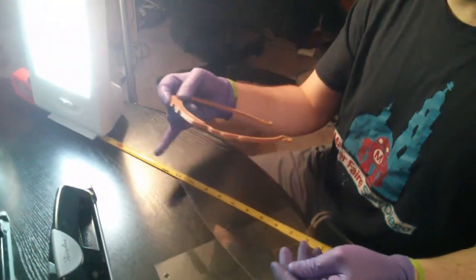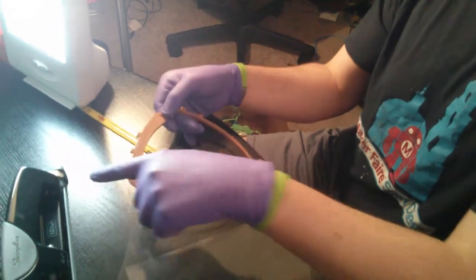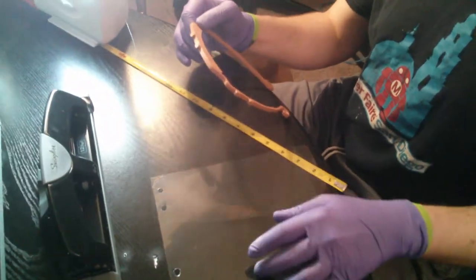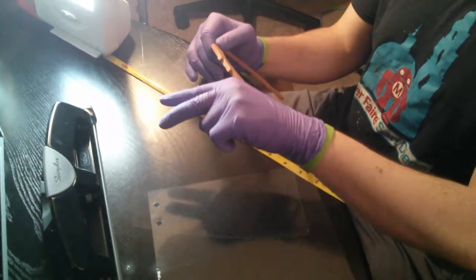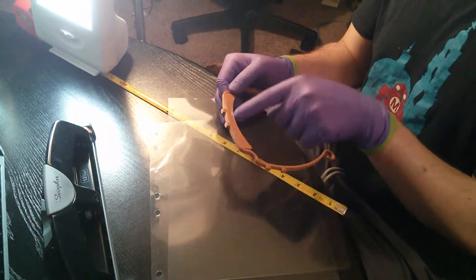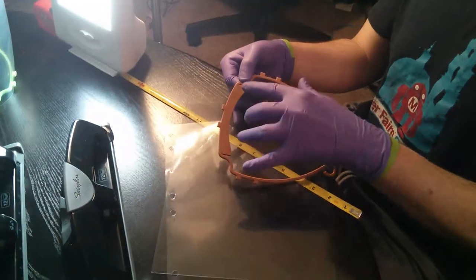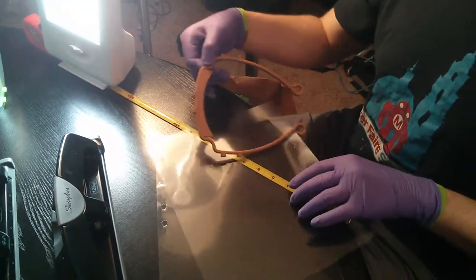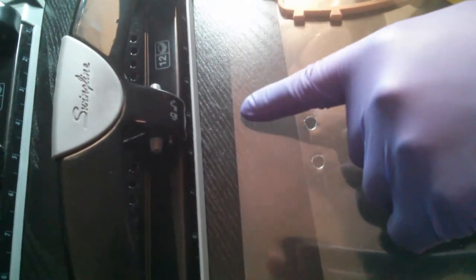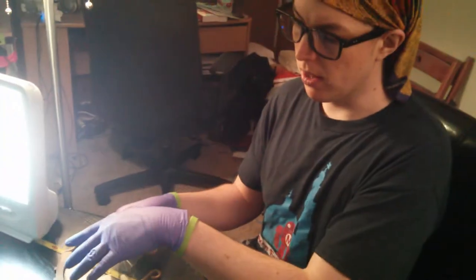The plastic part was designed so that these three holes — the ones on the left, that one, that one, and that one — those three nubs, the distance between them is the same as the distance between these. So what we want to do is put holes up here: three pairs, two there, two there, and two there, just like this one. We want those holes to line up. We know these are an inch apart from each other, so if we get the center hole right in the middle and a half inch to either side, there's a full inch between the two holes, and then the outer holes will just line up.